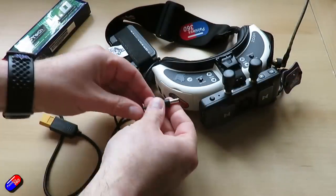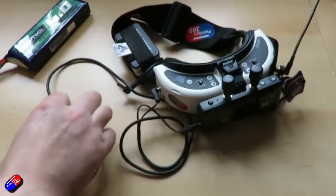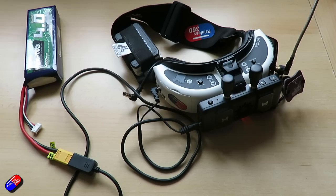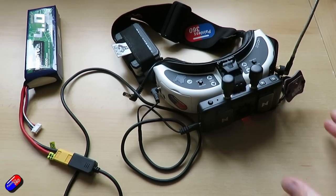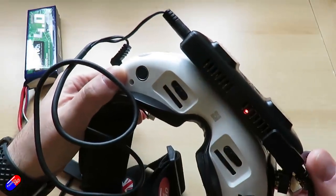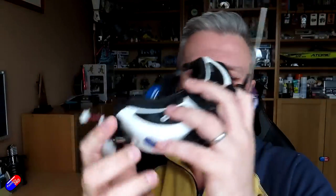For powering the VRX and goggles, there's a cable in the kit that plugs into the side of the VRX module and the goggles. It's designed to be plugged into a LiPo battery and drops that voltage down to roughly a 2S battery equivalent. If you have spare 2S batteries, you can use the same adapter to power both units. I'd recommend against trying to use older-style Fat Shark batteries — they just won't support it. Instead, use a nice two or three thousand milliamp-hour battery in your back pocket to run both and keep you going for the entire day.